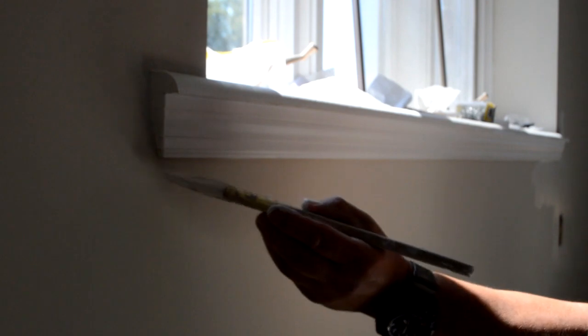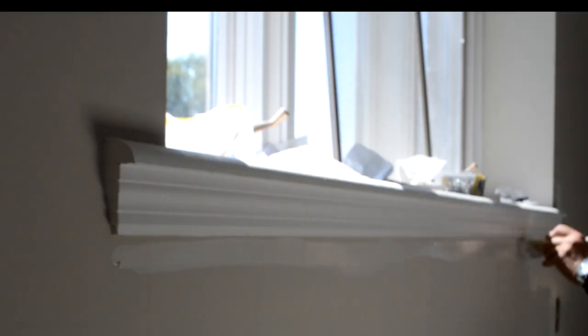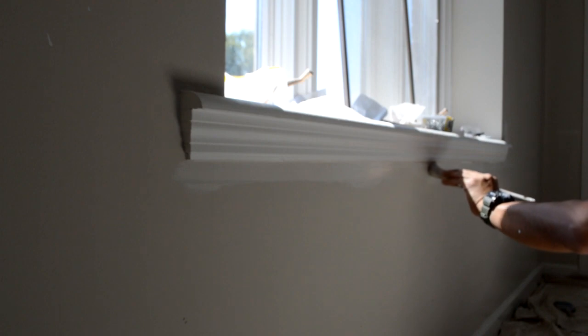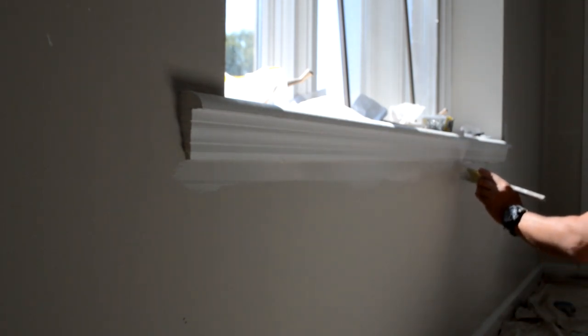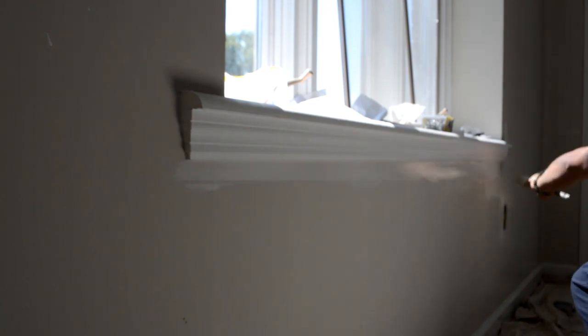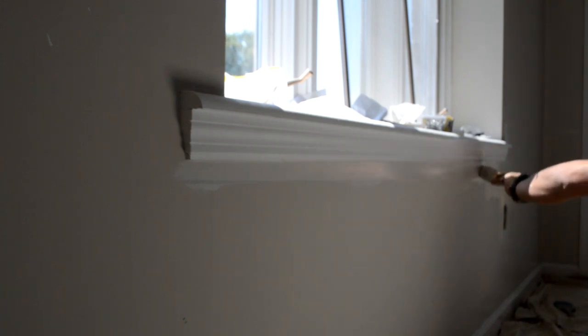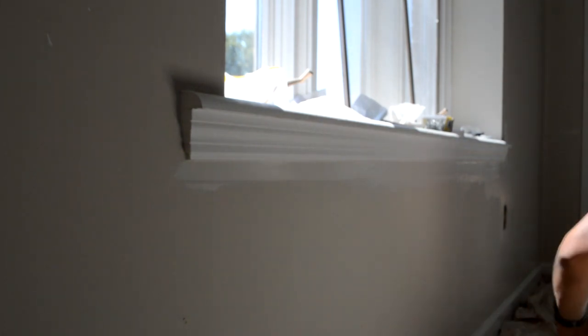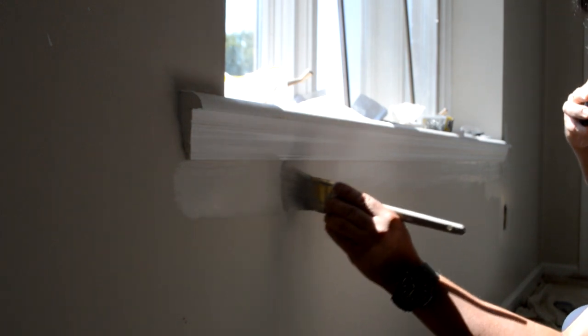If you have an upper crown molding or a small molding on the windowsill, apply paint fairly close to the molding without touching it in the beginning. Then, knowing you have paint on the surface, start from the very beginning with a nice line nonstop, and you can cover two, three, four feet at a time. If you have uneven surfaces — bumpy walls or caulk — go back and forth so that whatever you're not able to cut from one angle, you'll cover when you come back. Don't overdo it in one single direction or you'll have a lot of paint flowing onto whatever surface you're painting.